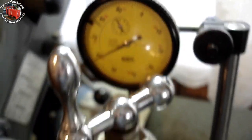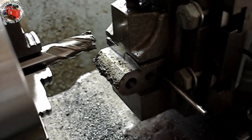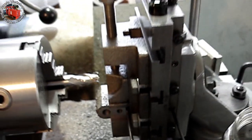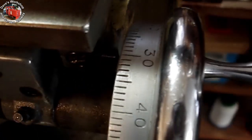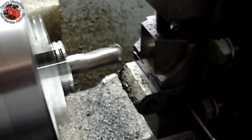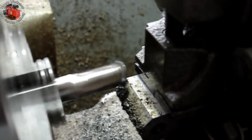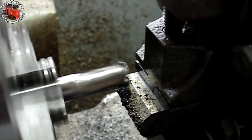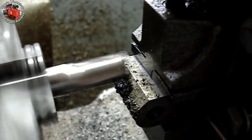59 on the plunger clock and 30 on the lead screw. Engage the clutch and let's make one cut. The cutter is running at 600rpm. It isn't recommended to mount milling cutters in the three jaw chuck, but I've had no problems and only take light cuts. The job has been brushed with cutting oil.